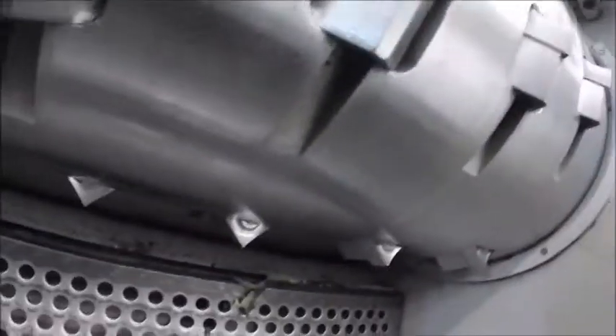Then once the screen is out, you take off all the material that hangs up in the back here. You're going to get all this material out of these angles and your hang-ups here, and let it drop down and vacuum out. You can see it's fairly easy to get to almost all the crevices on these knives — then it's just a strong vacuum and like a sweeper brush. That cleans off any material on your back screen support.